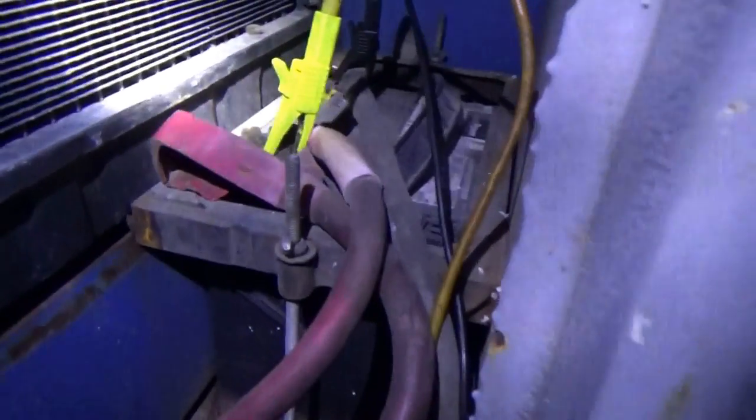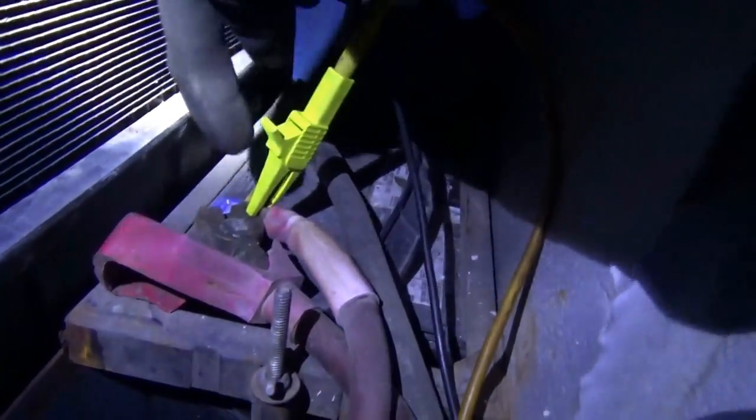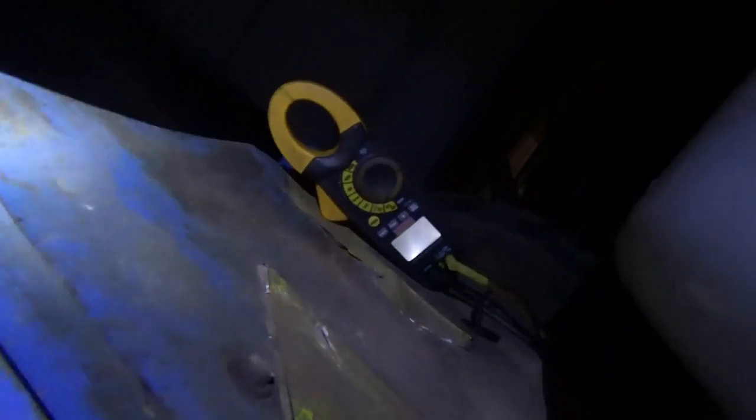Okay. Now I noticed just on visual inspection that there are two fat cables coming off of here, and one of them is kind of loose right here. So I want to do a voltage test only on that one. We're at 11.5 — I mean, this battery is not fresh — but let's crank it over and see what the voltage is on this wire. 11 volts.